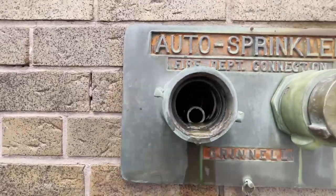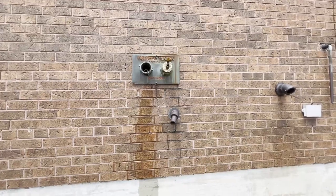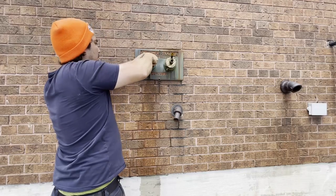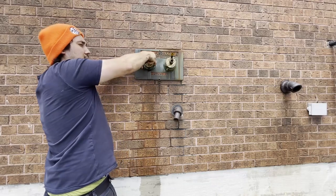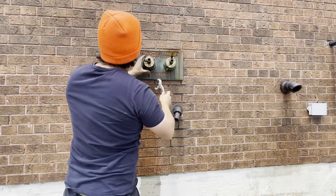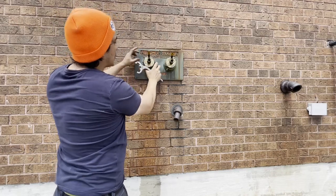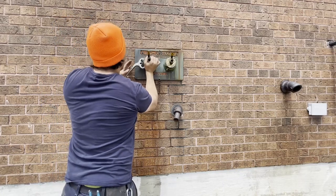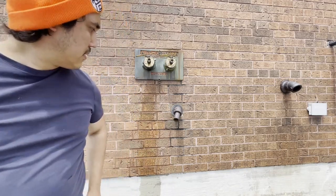I've already installed a pipe piece in there and I'm going to install my test cap. The reason I like to have test caps with valves is so when I'm ready to disconnect and drain the system — drain my fire department connection piping — I can just drain it outside. I'm not going to be worried about taking apart a live pressurized cap. Test valves are always good whenever you're unsure; valves are always your friends.